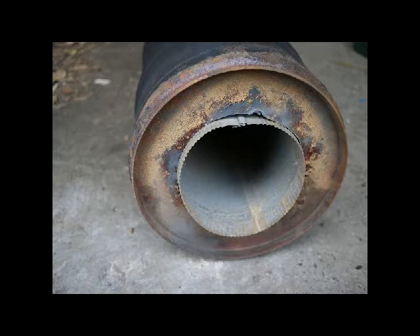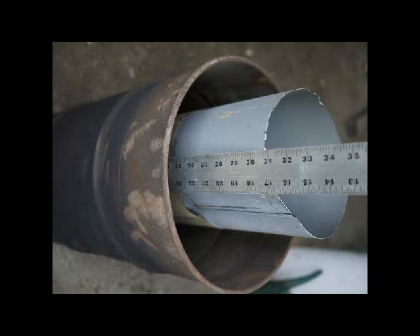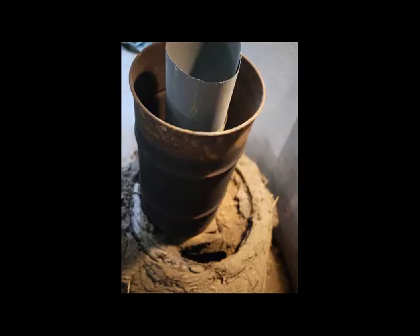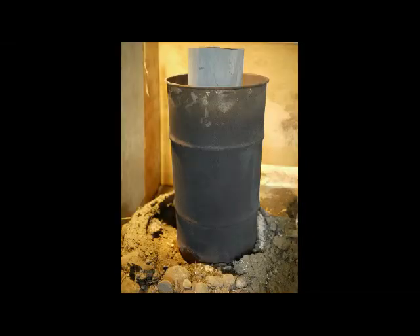You'll want to cut a hole — it should have an open top; if it doesn't, cut one end off. Then cut an eight-inch hole, just enough to let the flue pipe poke through on one end. Stick it through with the crimped end so it protrudes about an inch — that creates a seal so you can stack the fire clay and perlite in there. The flue pipe is about thirty-one inches; I cut mine with a cutoff wheel on a grinder — definitely wear protection. Then go ahead and set it up on top of your core, making sure it's nice and level. You can use a little bit of mud between the bottom of the barrel and the core, but you shouldn't need to.